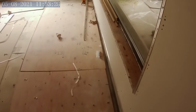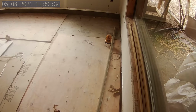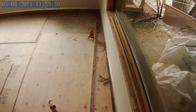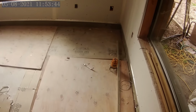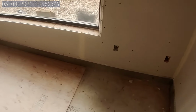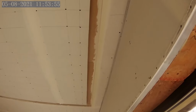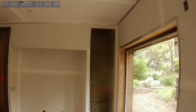So on Monday, they're going to bring some 5/8 L-trim. Drywall is 1/2 inch. That'll mean that we have a 1/8 upstand, which will be more than enough to hide the LED tape. And then, quite frankly, we could probably just use J-trim because the overhang is deep enough that we could hide the LED tape without any upstand. But the contractor wants to use L-trim, so that's what we'll use. So, just a quick run through and show you where we're at on everything.